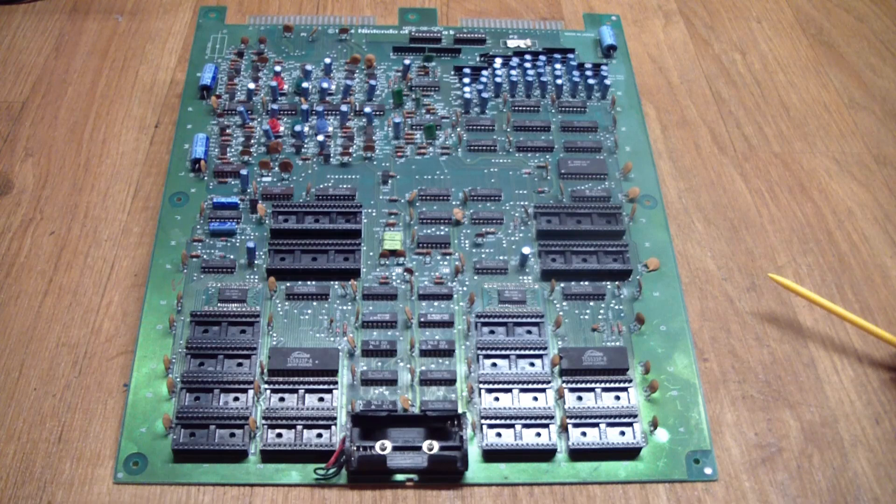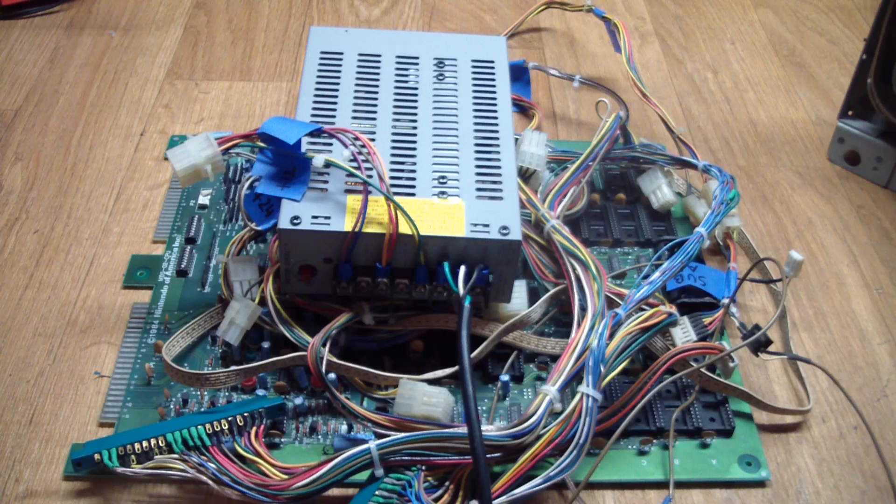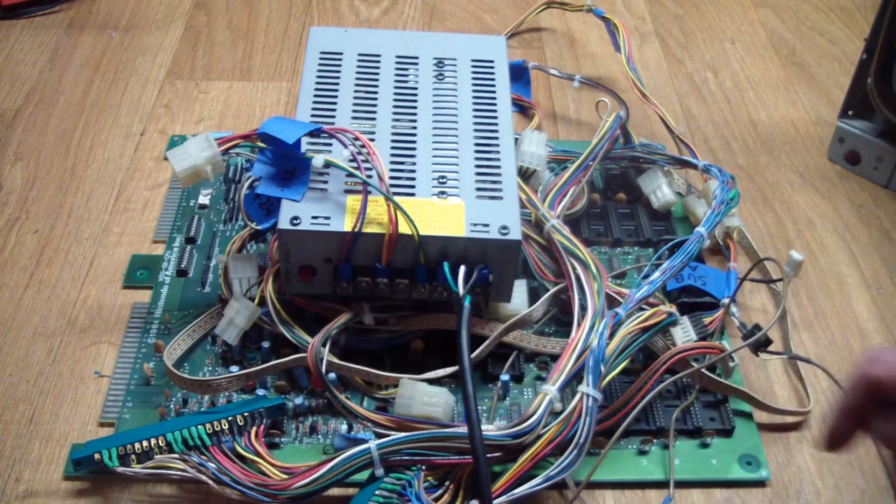So what we should do now is the boards are clean, but we don't know how well they run. We're going to have to bench test these. I had to procure some parts to be able to test this thing on the bench. The first part was easy — a switching power supply because it uses 5 and 12 volts. It also uses 24 volts, but that's for a mechanical coin counter, and I'm not going to put a lot of effort into providing those 24 volts right now — I can always get a small switcher for that later.